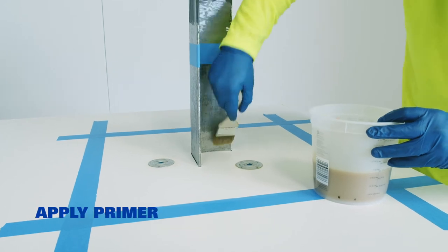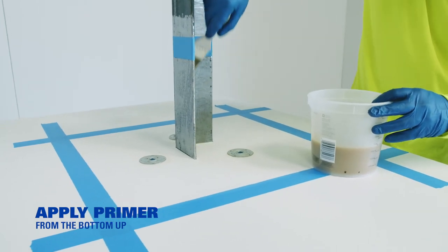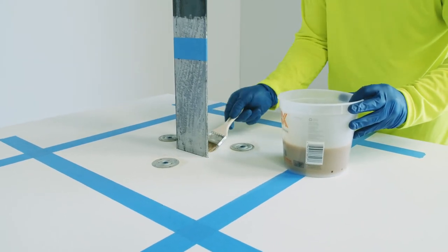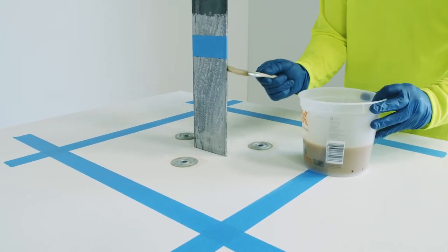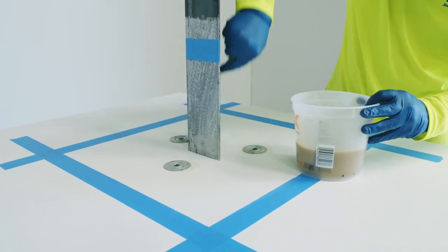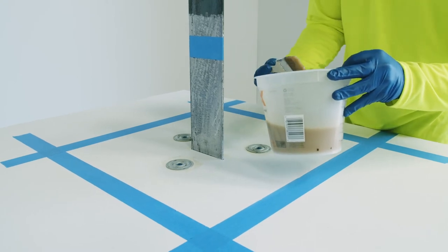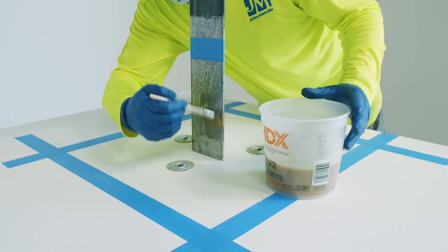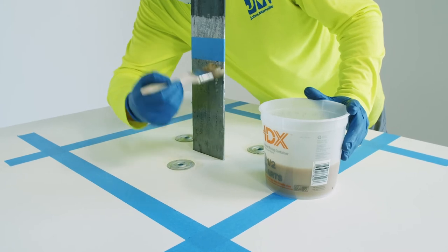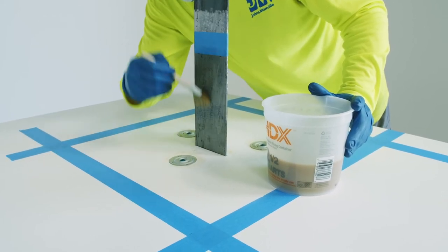It's a pretty thin primer, so I'm working from the bottom up — I've got to fight gravity, so I start at the bottom and work my way up. That way, if it does start to run, it runs down into the main body instead of pooling at the bottom. I noticed you're not priming the area above the tape. Once everything is cured out, that would be a good time to re-tape the single-ply liquid flashing and then use a rust-inhibiting primer or paint to go from that line upward to make sure you don't have any rust occurring on the metal pipe or angle iron after that.